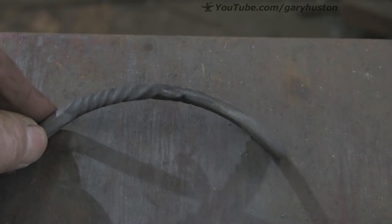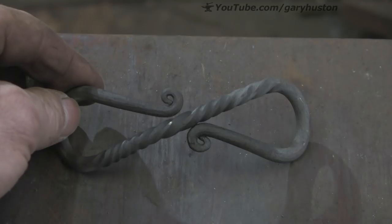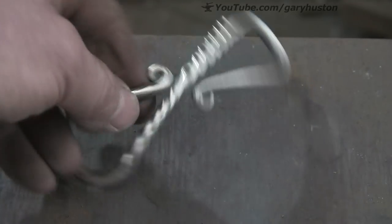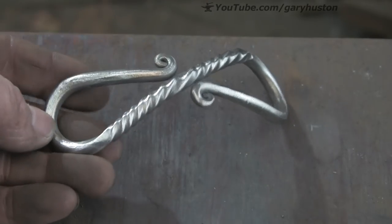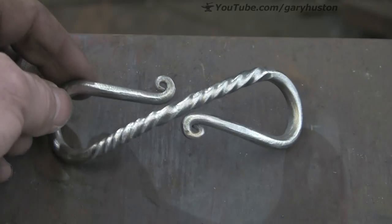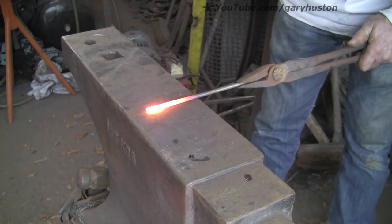You can see there — look at that. You wouldn't get that quickly mucking about with it on the anvil. Let's give it a quick wire brush up. Now I'm going to leave it satin, I'm not going to polish it — I like the satin finish for this type of thing, and it leaves the hammer marks showing. You can see how nice that shape is. I don't know if it's enough shape or too much shape because I've never made one, never used one, and don't know anyone who uses one. Now we're going to start on the pin.